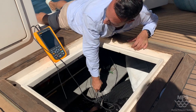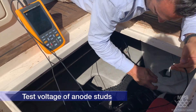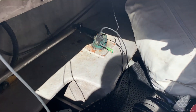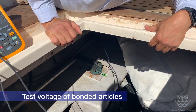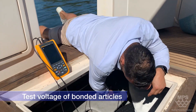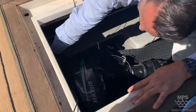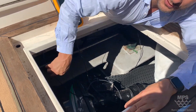On the back transom we're showing 820 millivolts. If I pull it off and go check the port side rudder, we're showing 624 — that shows we've got a bonding issue there. We then go to starboard side: 625. Then we'll go up towards the engine room.